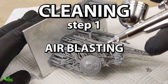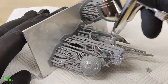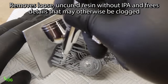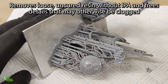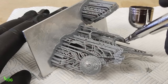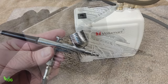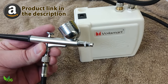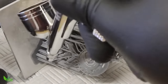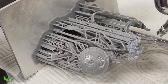With my prints fresh off the printer, I've found a very useful practice is to quickly blast away excess resin with a spot of air. I concentrate around detailed areas and the supports, as this is where resin builds up. Now this is an optional step, but it does help considerably. This is a cheap and cheerful airbrush with a mini compressor and whilst it's not fantastically powerful, at this scale it works well and comes in useful more than once.